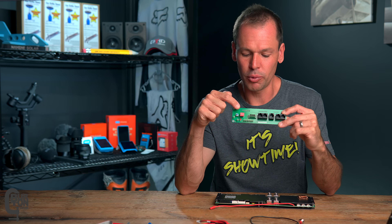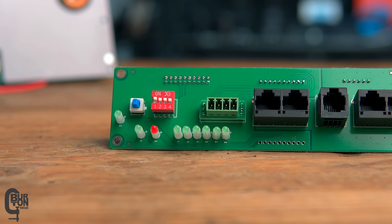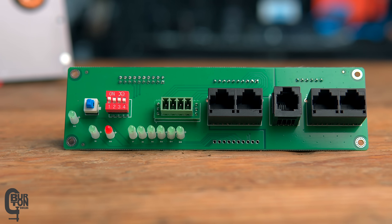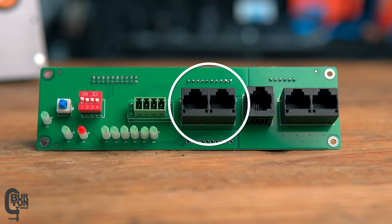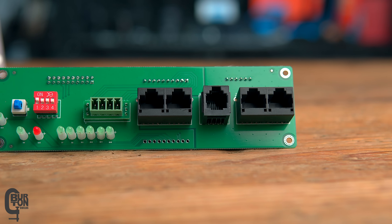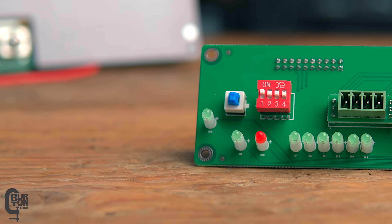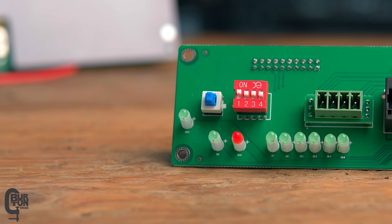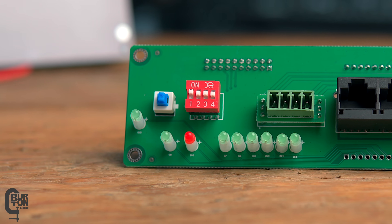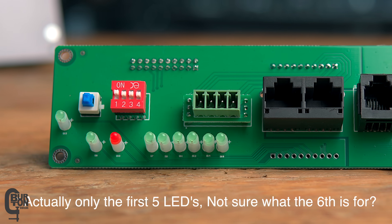Looking at the interface board, it's got some DIP switches, some connectors, a few LEDs, and a push button. Starting along the top row: the blue push button is a reset button. The four DIP switches are to set the RS-485 communication address of the battery. The green connector connects to the dry contacts of those two programmable relays. The first set of RJ45 ports is for RS-485 and CAN communication with your inverter. The middle RJ11 port is for RS-232 communication. The last set of RJ45 ports is for communication between battery packs. The green LEDs indicate BMS on/off, running status, and a red LED flashes for fault or alarm states, which you can check in the JKBMS app. A row of six green LEDs indicates the battery state of charge.